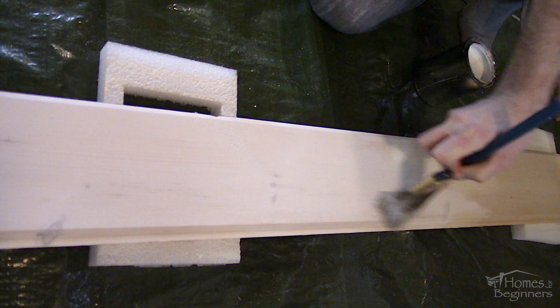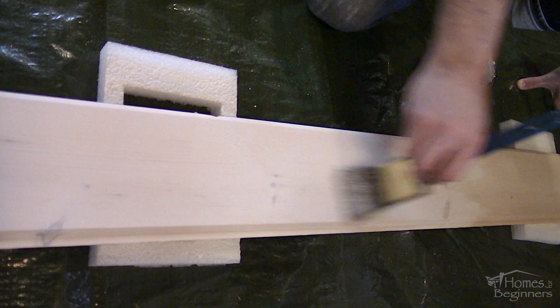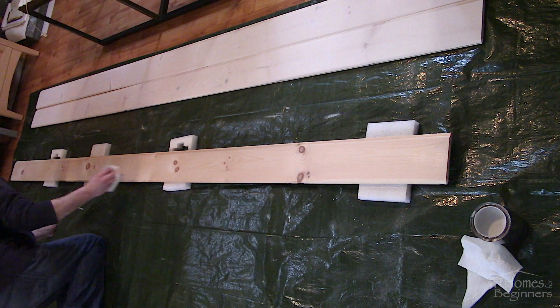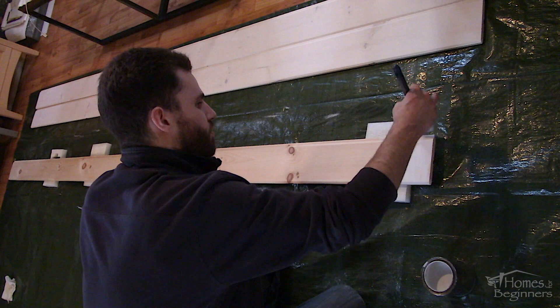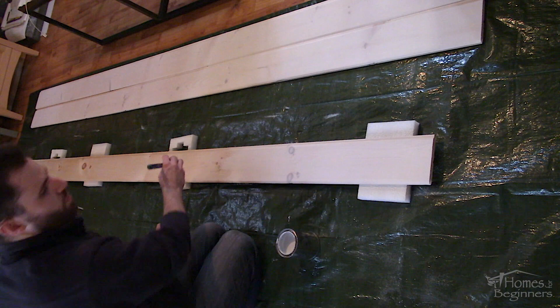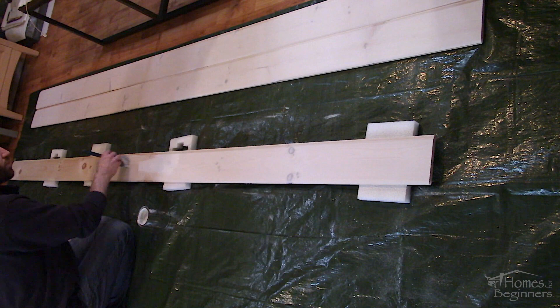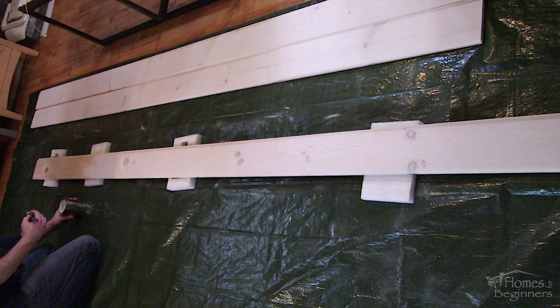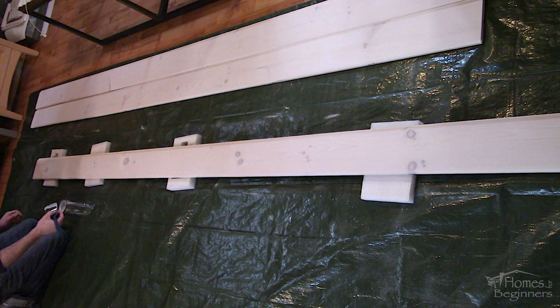The paint is only applied to the visible side of the boards. Depending on how long you've been using the paint in one application, you may need to mix it from time to time. Work from one side to the other and don't stop your application midway through a board, otherwise you will notice a transition if the paint dries. This finish cannot be achieved using a roller or spray, as you're not able to control a thin dry application. While some people do wipe off the excess paint, it's not needed here. I did find that while the paint was still wet it has a more solid color appearance, but after it dries the grain does tend to show up more. When done, allow the boards to dry overnight. Only one coat is needed — more coats will hide the finish on the wood, giving it a more solid color instead of a whitewash look.